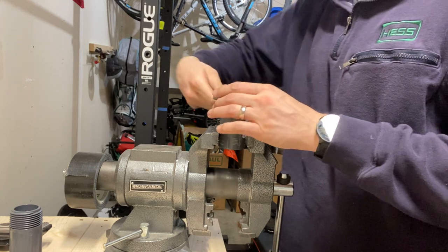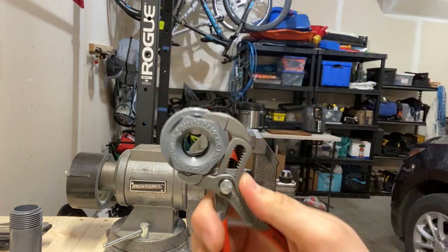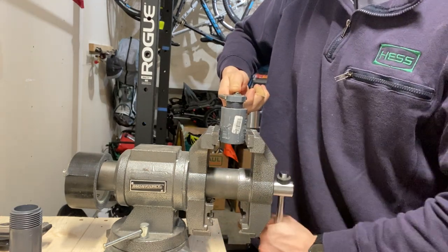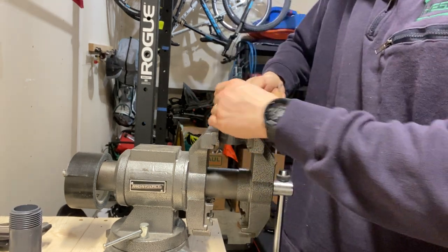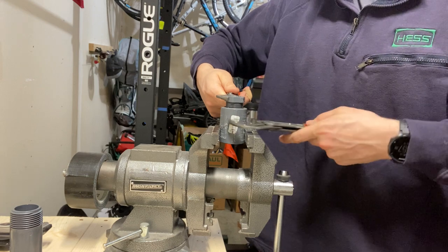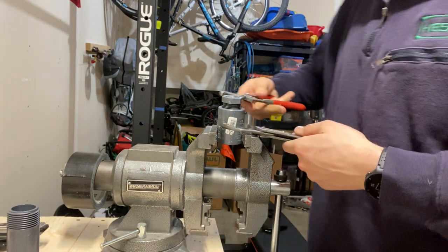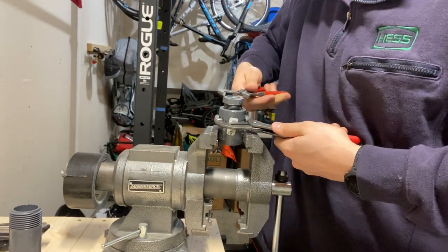Let's do it with the 125s on a one inch fitting. I'm just barely able to hook the top — I don't think it's going to make it. You can see I'm hooking the top and the bottom is going to try to dig into the hexagon. Let's tighten it up — I've got to hold it. You saw how much force I was applying there. Now let's see if I can get it tighter with the 180s — definitely can, it's a heck of a lot easier.